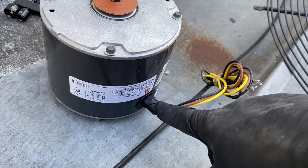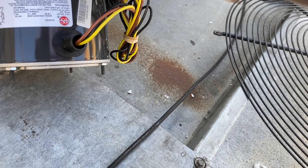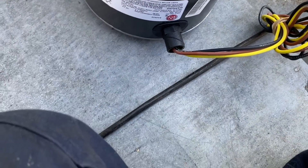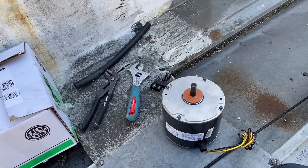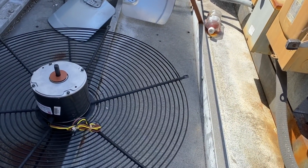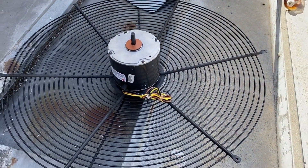There's the motor with the connector for the flex - it is a direct replacement. It says E22922 on the motor, but on the box I got CA3412. In case you guys ever need one, it makes life super easy when things just fit right up. For the mounting, you're going to need to save the nuts off the old motor - it doesn't come with mounting nuts, just reuse the ones from the old motor. We'll get the flex on there, mount the fan blade, and get this remounted in the unit.